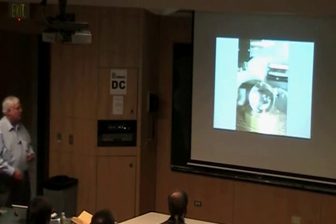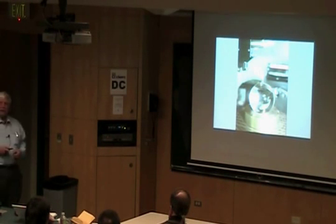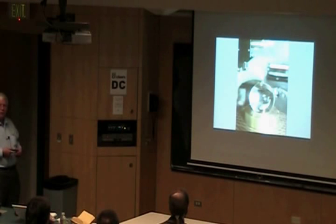And locally where you measure this thing, we had one glass ball we used to measure repeatedly, and whenever we tore a machine apart and replaced the components of it or made a new machine, we'd measure the same ball and make sure the radius hadn't changed. And it never did. It was usually good to a millionth or so each time.